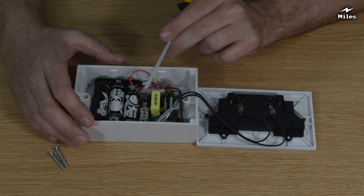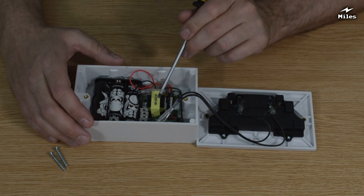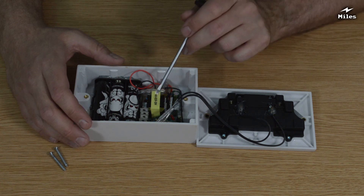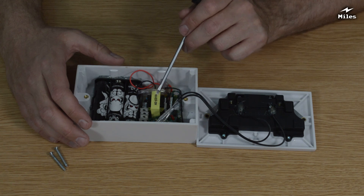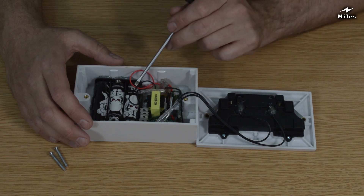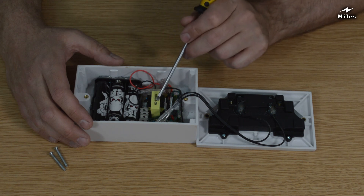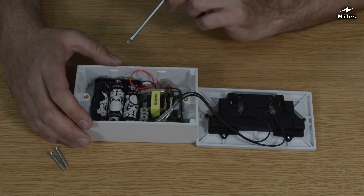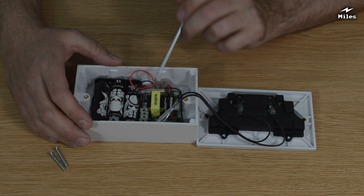This particular inverter had lots of vents all the way around it, so it's rated to 150 watts, and I imagine it would need all those vents if you were running 150 watts. In this back box it's obviously self-contained and it's going to get quite warm. Also I don't think these wires are really up to that kind of amperage, which is why I've downrated it to about 50 watts on the sticker on the back.